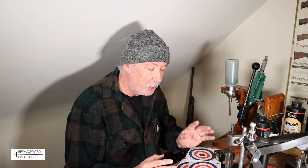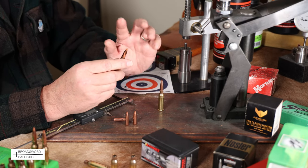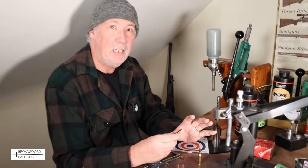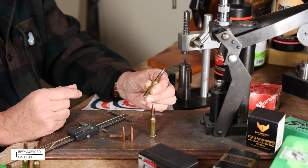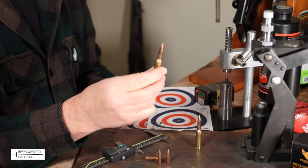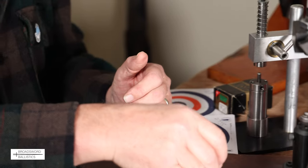One thing you have to remember, like all reloaders, when you're testing a new gun, is you need to check the overall length of the bullet, one for pressure issues, and then also for feeding through the rifle itself. As you mentioned earlier, the magazine is set up to actually use an extended length bullet, which is really good on the Sako. I found here, using these ballistic tips, 120 grain, you can go to 2.85 of an inch and it still fed correctly and chambered correctly. But the best accuracy I got was 2.79 of an inch. So that's below the recommended overall length of 2.8 inches. Anyway, I won't go through all the overall lengths because it'll take too long to explain.